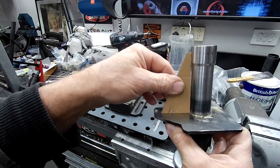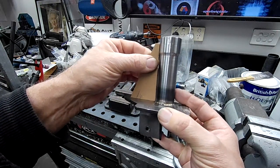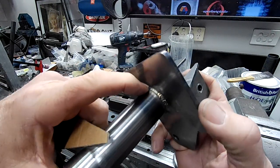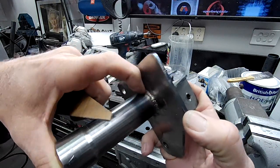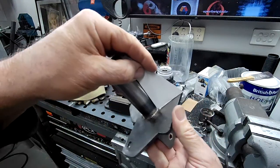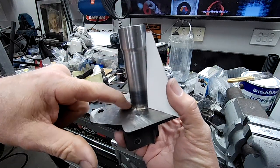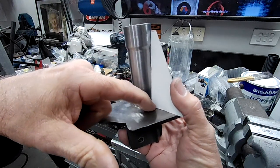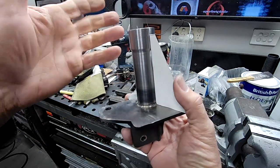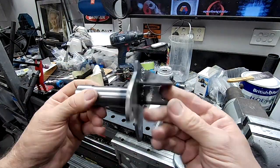I'll work out the gusset position once I kind of get it in position. This weld around the bottom here is really just a root pass to get right in and get really good penetration into that corner. When I set up these gussets, I will weld along both sides of the gussets and also weld back over that to get a little bit more weld depth in those internal corners. Once the gussets are in it'll be absolutely fine. So I might just bolt this up and show you where it goes.